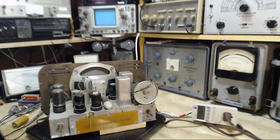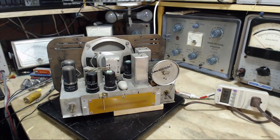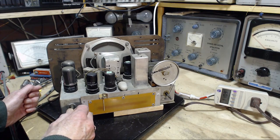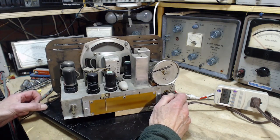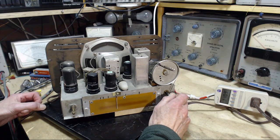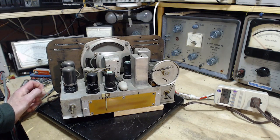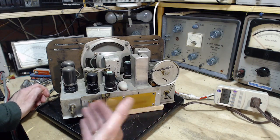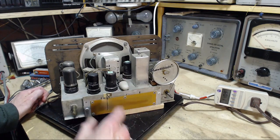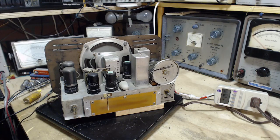Well, I don't think we're going to get any really good reception. My tripod started falling over. So I think the next thing I've got to do is the alignment on this. Then after that, we can judge again whether it's able to receive. It should receive. A decent radio is going to receive 4 or 5 AM signals in here, mostly done with a loop antenna on the back of these small radios, not with a wire.